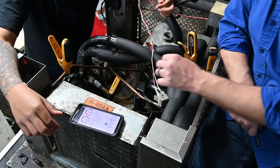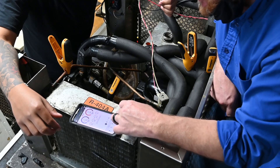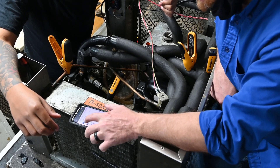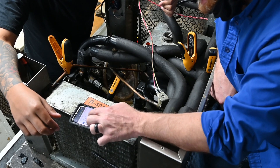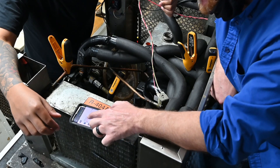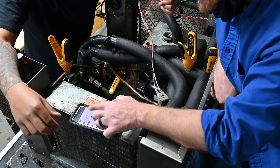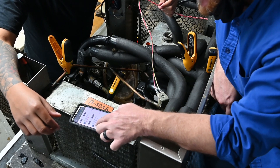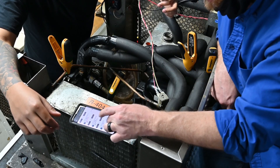Now let's go to our system and take a look at our numbers. We're going to make sure we're mapped correctly. I'm going to go to probe manager — make sure we're right. Low pressure, low pressure side: 32 — that's correct. High pressure, high pressure side: correct. Suction temperature: 48 — that sounds about right. Liquid temperature: sounds about right. Discharge temperature: sounds about right. Outdoor temperature: good.